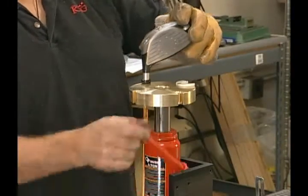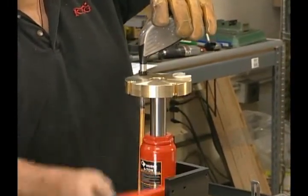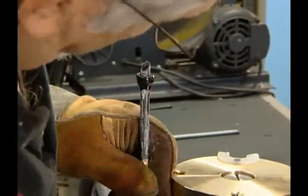After heating, remove the head. Please use caution as the head will be hot. The shaft is quite long, so it requires a puller that will go all the way up. Then, pull off the head and remove the shaft from the extractor.